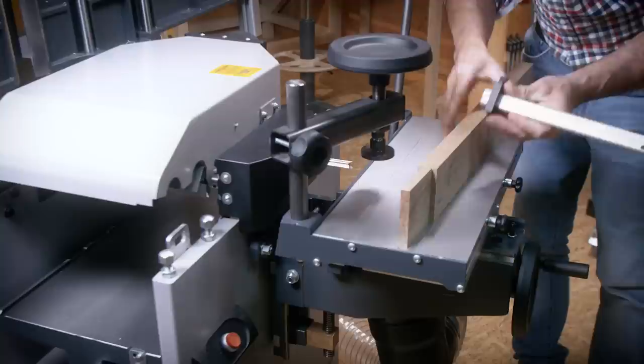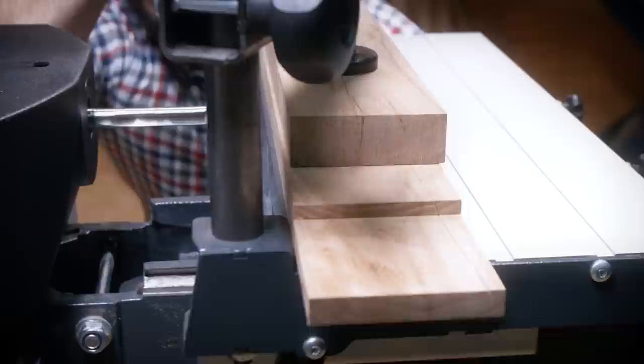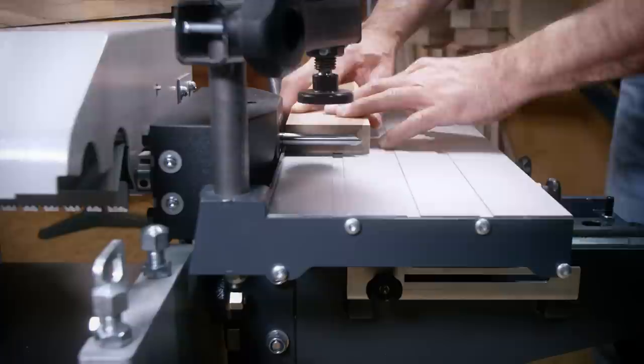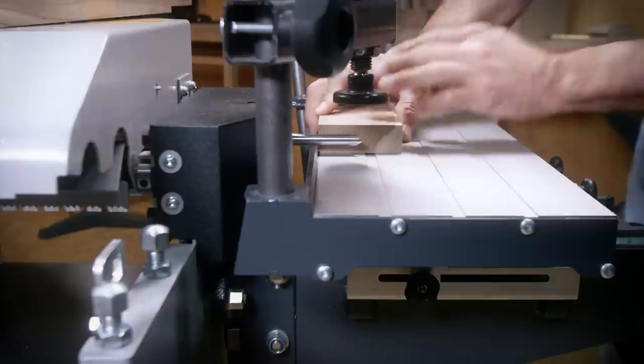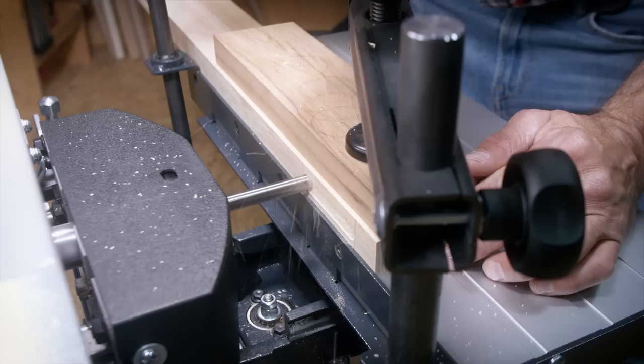Again, we use the moulding gauge to scratch a mark on a test piece, then we adjust the height to the mark. Using the thumb screw, we set the cutting depth, which is slightly above the center of the workpiece. Here you can see the advantage of a slot cutter compared to a conventional mortising bit. The slot is cut with a depth offset of approximately 5 millimeters.